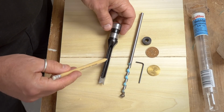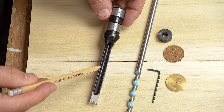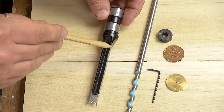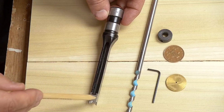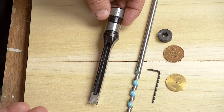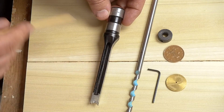If you look at the main fluting of the chisel, it's a really clean finish in there. It's also coated with a chemical blacking which is very low in friction. You look at the main shank as well, you'll see that relieved. It's slightly smaller than the main cutting area, and that means it's a lot easier once you've done the first hole or chisel, to actually pull that chisel back out again. It doesn't grab on the sides here.